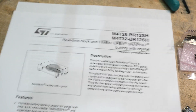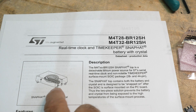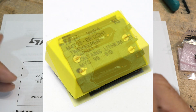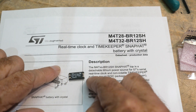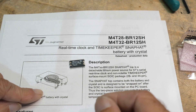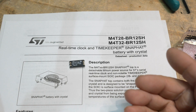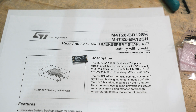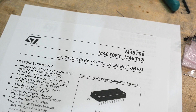Here's the little piggyback unit. It's got the four little pins and it snaps on top of the part. Why would you buy two parts instead of one? Well, this can go through the standard surface mount process, and then the secondary process is just snap something on. And then if you need to replace it, you can just buy these separately and replace the battery when needed. Anyway, chip of the day was the M48T18.